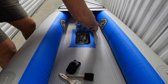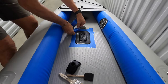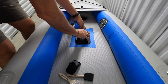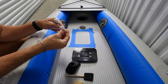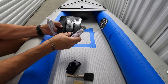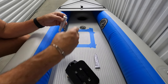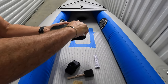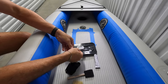That's what I'm doing here, and theoretically I should just be able to lift it right off after I'm done gluing. Now, from Sea Eagle you can order this glue — it's special PVC inflatable boat repair glue. I already have one open from when I installed the other one. I'm going to basically squeeze as much of this as I can onto this pad.